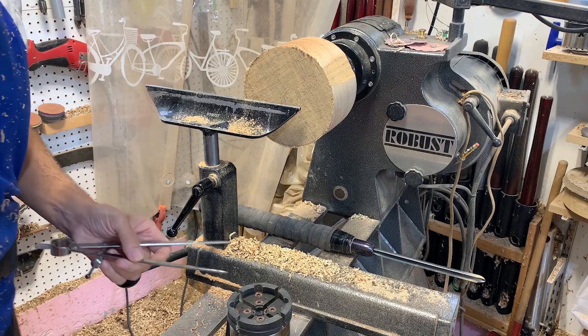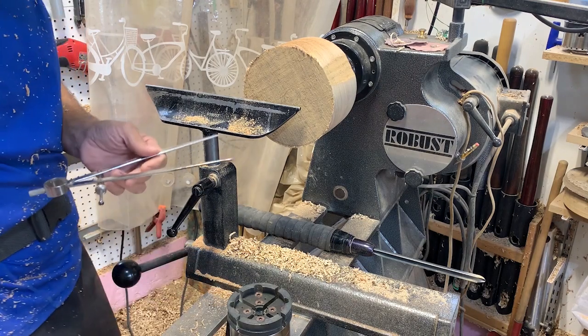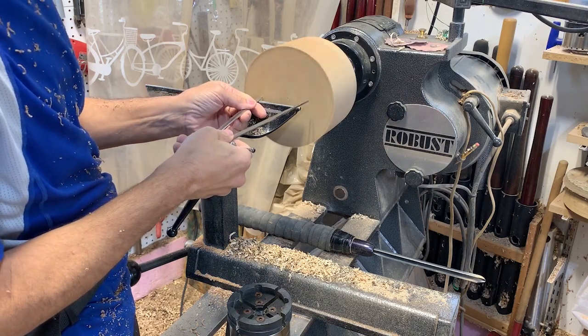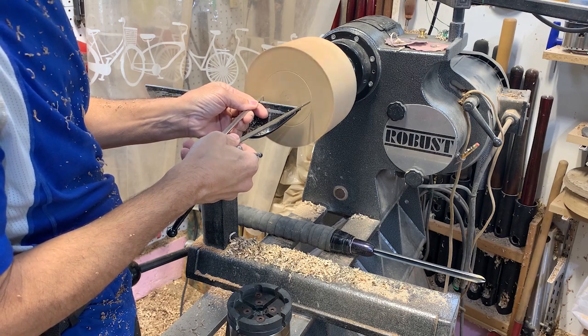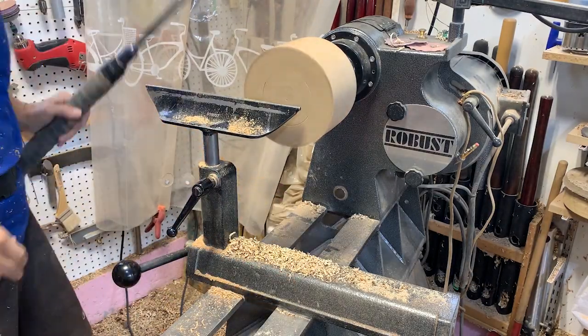Now this is the very bottom of the Bravery Bead bowl, and in this case I'm just going to use an inside mortise to hold the piece. Typically I use an outside tenon, but I think in this case the piece is very light, and I'll just use a dovetail mortise on the very bottom.